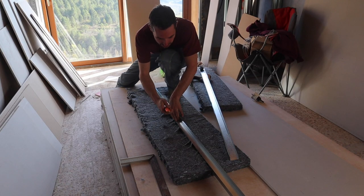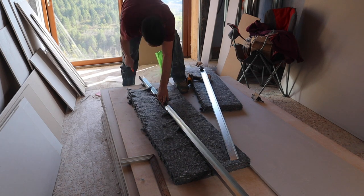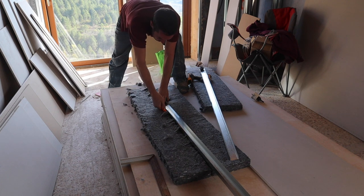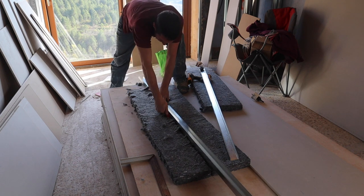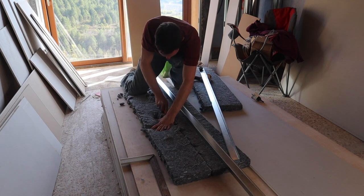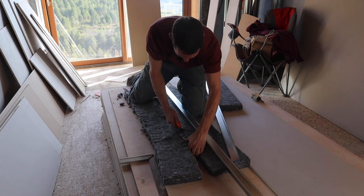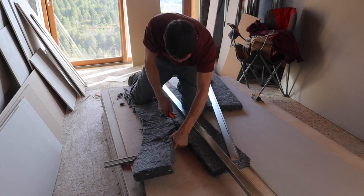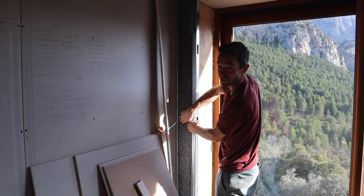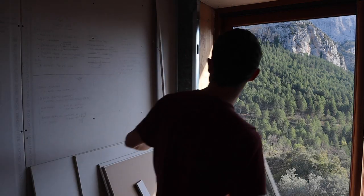So far the best way to cut this cotton insulation is to basically compress it and then do long cuts. I'm going to put this stuff in the little gap by the door and that's done. I just put it together so it's really snug — there's a little bit for the conduit, but that's not too bad.